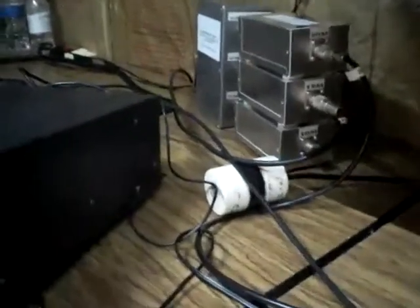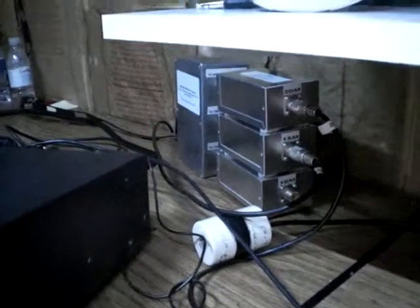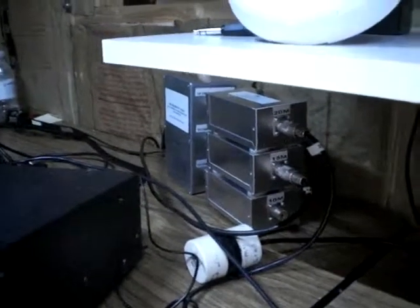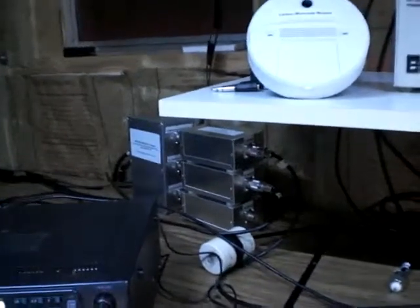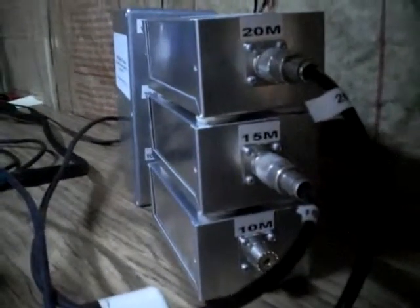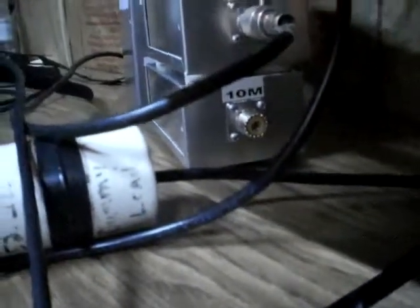The intriguing thing about this is that Marty and I are both using the same antenna, which is a tri-band Yagi right outside of the building here. The magic is the HF triplexer which separates Marty's signal from mine. Then we use bandpass filters — Marty is connected to the 20 meter bandpass filter, and I'm connected to the 15 meter bandpass filter.